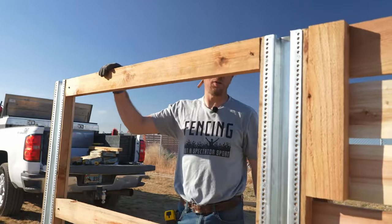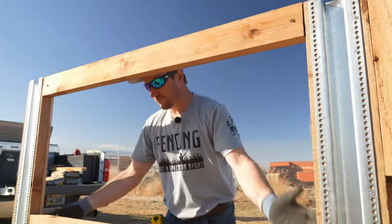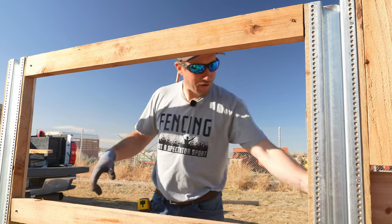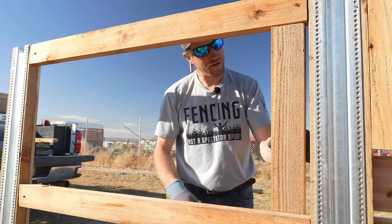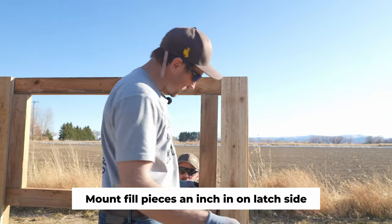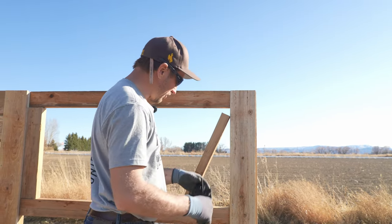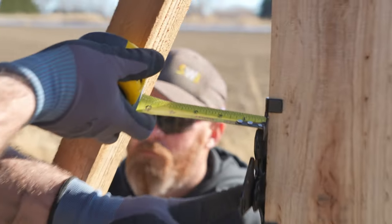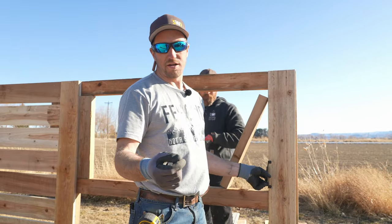Because it is a horizontal fence, we can't install our pickets horizontally in mid-air, so we're going to cut a fill piece and run it from here to here. We're bringing it in an inch because of all the hardware that sticks out — the bolt thickness, plus the latch bolts. That's a half inch for the hardware, another quarter inch for the bolts, and another quarter inch of extra clearance just to be sure.